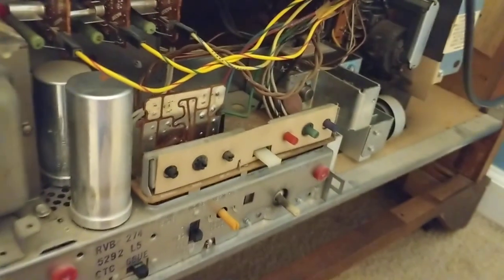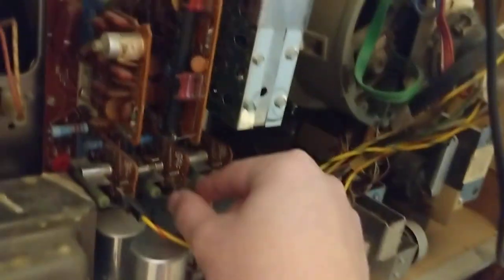So we're going to pause the DVD and put this into service mode, which gives us just a blank raster screen. We're going to turn red to maximum, then down everything else. Then max green and down everything else. Then max blue and nothing else — and blue is very, very bright, as you can see. So there's something going on here. We can not do this while we're plugged in.